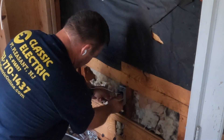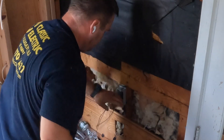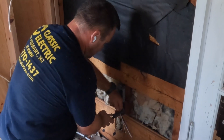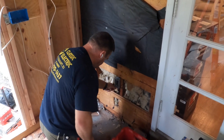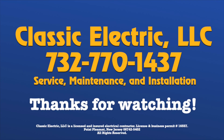I will tuck the equipment grounding conductor pigtail on the back. Then I'll use the length of my fist around these conductors before I cut the wires. Then I'll tuck them neatly into the back of the box and I'll be ready to go. Thanks for watching this video, guys, and we'll see you on the next one.